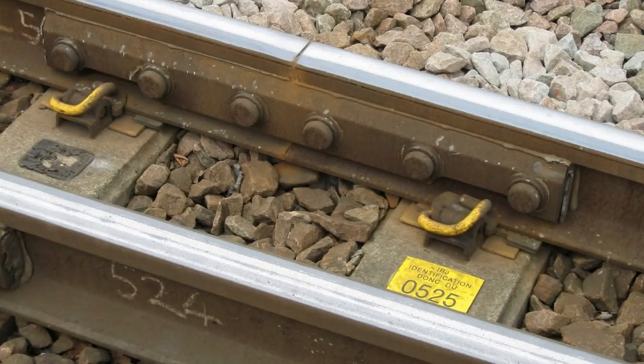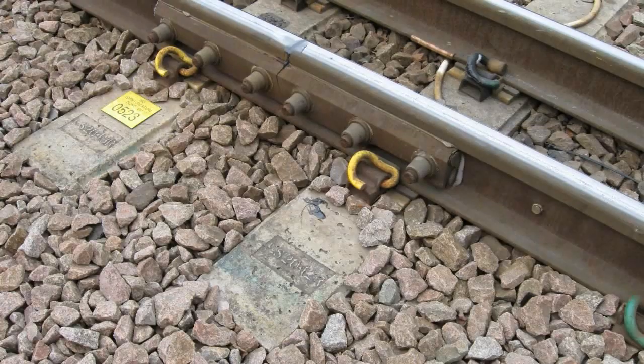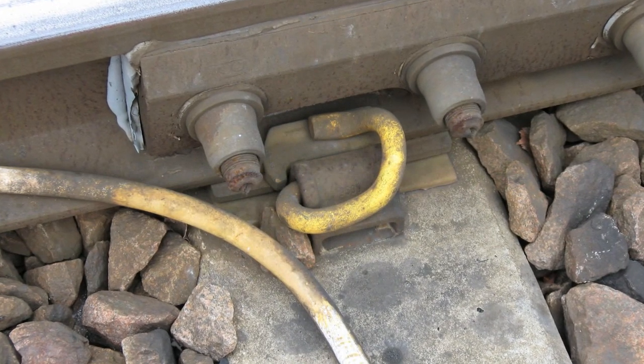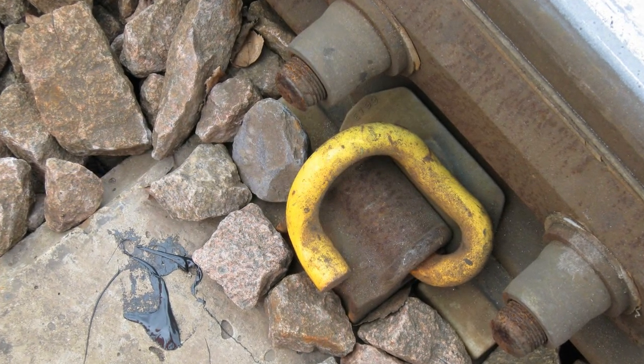It's also important to check if the joint has been correctly installed. Is it correctly supported, such as is there the correct sleeper spacing? Have the correct number of bolts been used? Are the correct clips being used? As the wrong or incorrectly fitted ones can lead to a short circuit if an insulator hasn't been fitted.